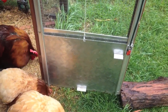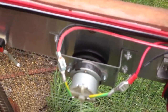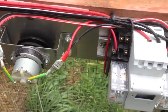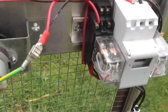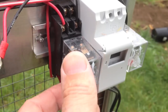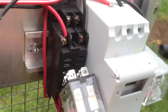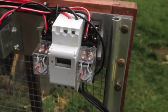Okay so here's the finished product. As we go up to the top we can see the motor assembly here — it's all fixed, secured and wired in. It's powered by a timer and relay unit. The relays we've used on this occasion are the larger version because they're DIN rail mounted to prevent soldering. You can see they literally just clip in and out.